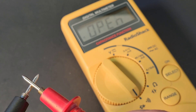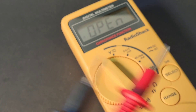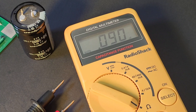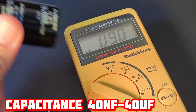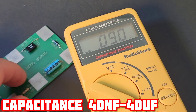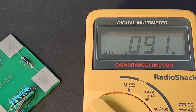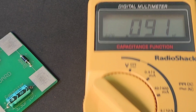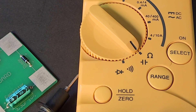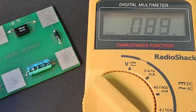This had really good continuity — not the loudest, but it latched really quickly. Awesome. In capacitance mode, it only has a 40 microfarad range max, so a 10 millifarad cap won't even come close. Even though it boasts a capacitance function, it was really still rather limited. We also have a little bit of parasitic capacitance reading 0.091, and there's no way to rel it, as the hold-zeroing function is not for capacitance. Too bad. Still, it worked pretty good.